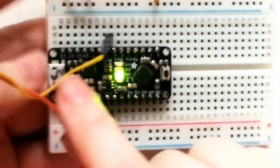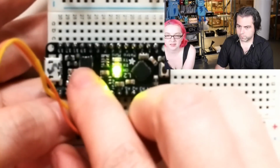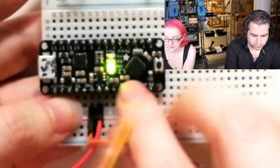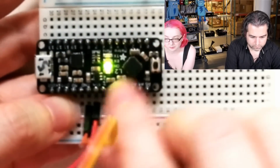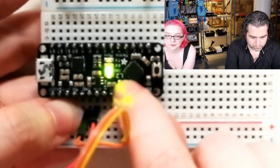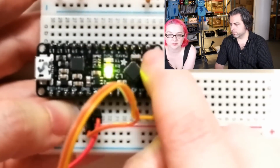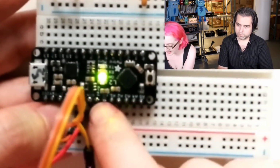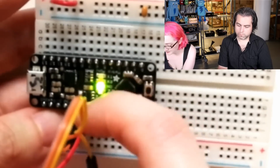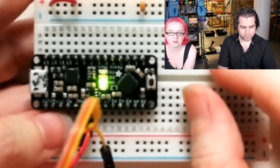Okay, so here is my Metro Mini, so I'll unplug it. We have a micro USB jack, and this is an FTDI chip. We have some LED indicators. So, for example, an LED lights up when you press the reset button. And then there's an Atmega328 chip with a crystal, and then we have all the pins brought out, 0 through 13 here, analog pins, VIN, ground, has a regulator, has voltage input protection.